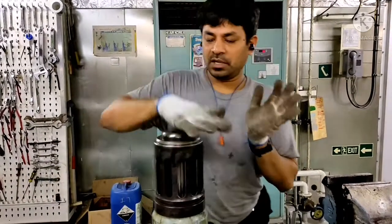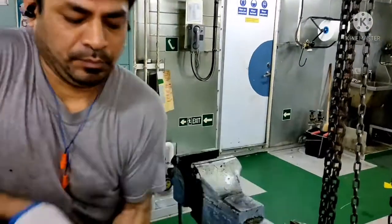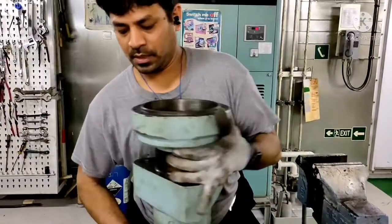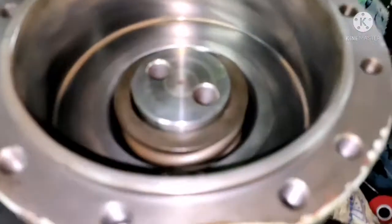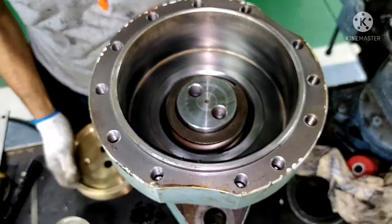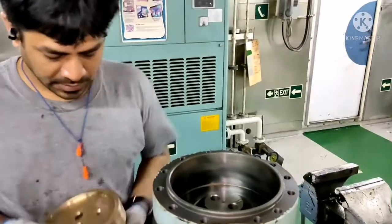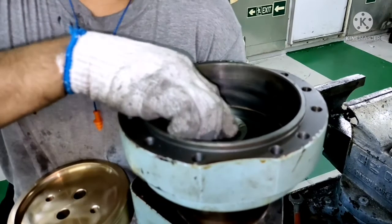The valve is now fixed inside the starting air valve body. Now next will be our spring — the spring should go inside. And next, your piston — the piston should go inside. So what do you think you need to check when you are installing your piston? These two holes should match your spindle bolt area.